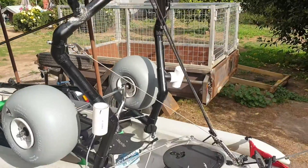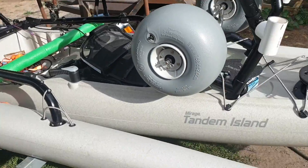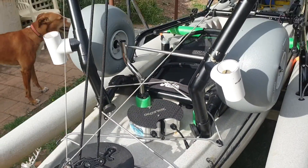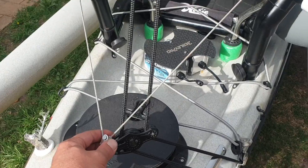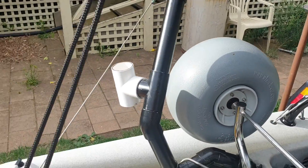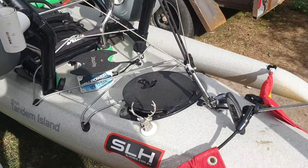So for a long weekend out fishing you don't have to charge the battery - that's three nights of fishing. It's about 30 odd amp hours to run the fish finder too. I didn't like how much movement there was in my design, so I grabbed a stainless steel line off an old 125 dinghy I had, anchored it up three quarters of the way up with little stainless steel eyelets, and looped it down through a shackle.